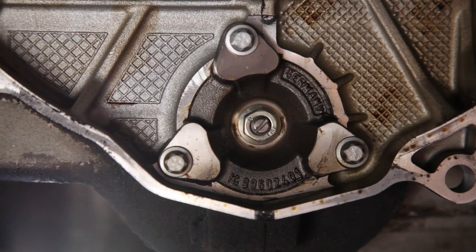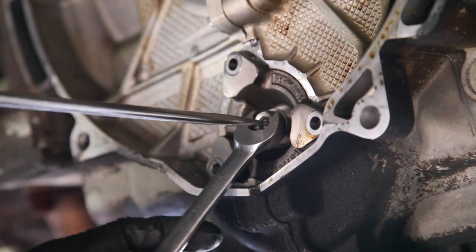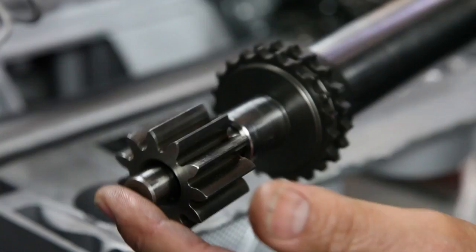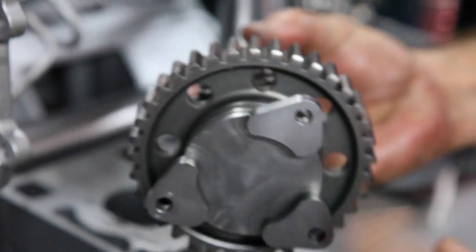When one retrofits or modifies their Porsche 996 or Boxster engine with a cylindrical roller bearing with forced lubrication through the shaft, the engine will never fail from the IMS. The IMS bearing in this case and its lubrication make the engine robust, and to the point that it is a correction to the problem.